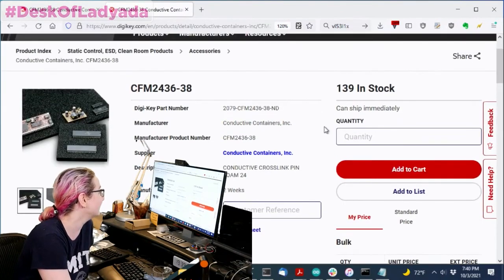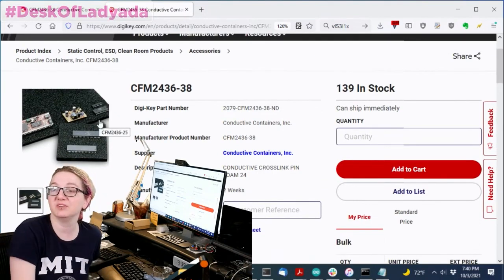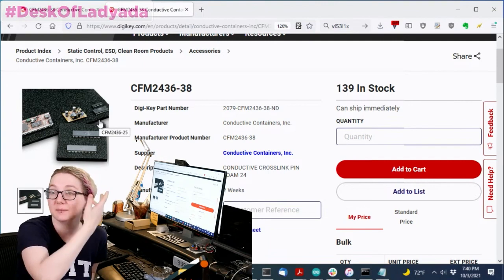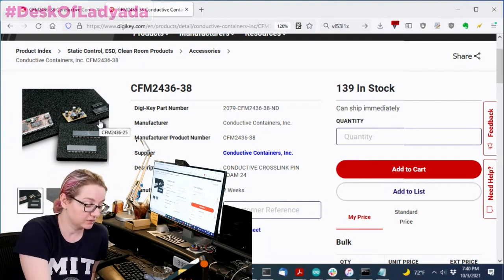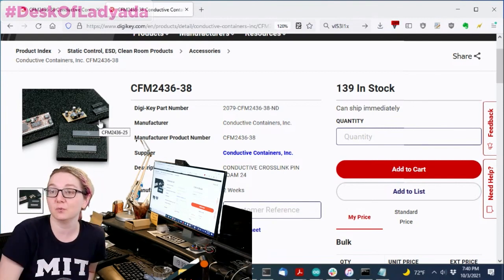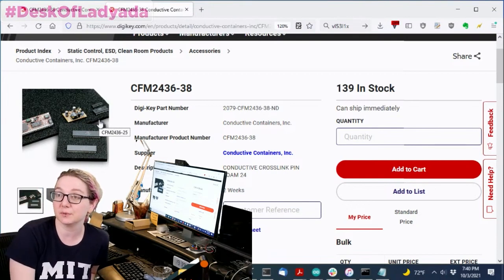You do get a large amount — six square feet — which is a big chunk, so it's not cheap. It's like 50 to 60 bucks, but you get a lot. I would buy 10 sheets, which would last me about six months when I was doing kits. I'd put chips in them, and you can put feathers in them. And of course, if you are using stacking headers or extra long headers, you don't want 3/8 inch — you want 1/2 inch or whatever. Just measure whatever it is and add a little bit. That's the thickness of foam you want.